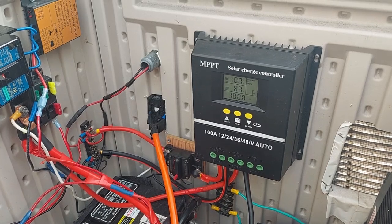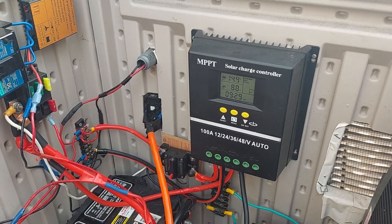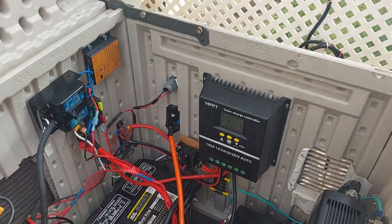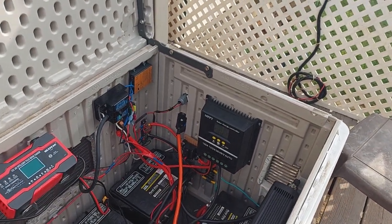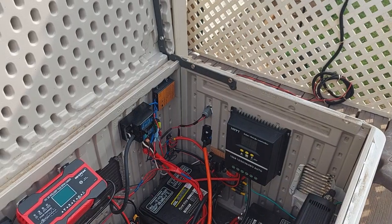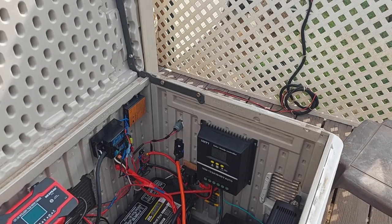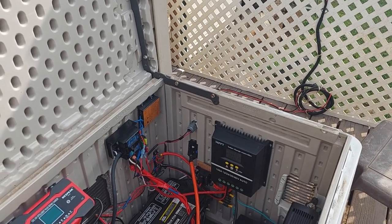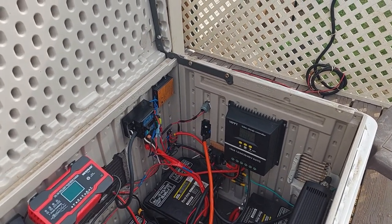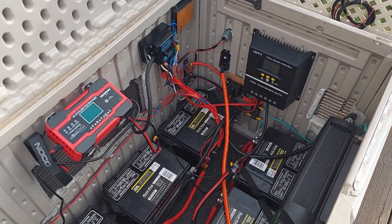Since I raised the high voltage disconnect from 12.9 to 14.4, it's been working super. Having that higher level means I won't have issues running certain things. About a month ago I was trying to run my air conditioner off this system. It was doing it and then it popped off — I guarantee that was because I wasn't allowing enough voltage. Everything was just out of balance. But since the adjustment, batteries have been super and I feel pretty good about this.